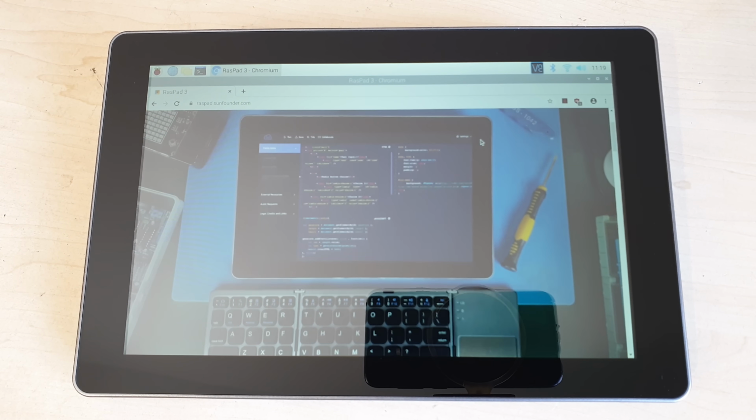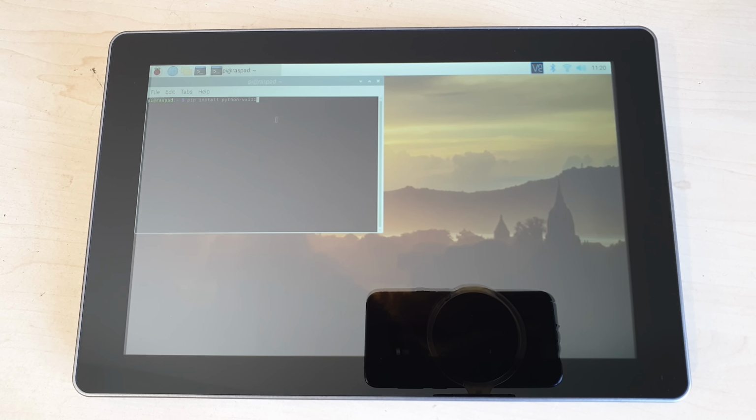Now, to use an ordinary USB GPIB adapter, you'll have to download and compile the Linux GPIB project, which needs kernel headers and more, and isn't even compatible with all of them. My lucky Ethernet gateway needs only the Python VXI11 package, and we are ready to talk to GPIB devices. We could immediately write data into CSV files. But I want something a little bit more fancy than that, so I'm going to install InfluxDB and Grafana. Those are pretty popular for data logging on the Raspberry Pi, so you can just follow tutorials on the internet.